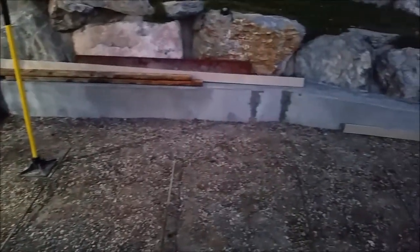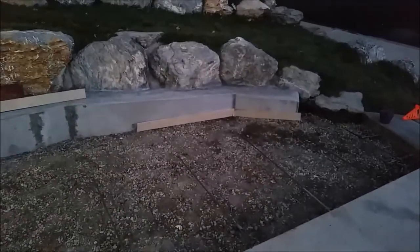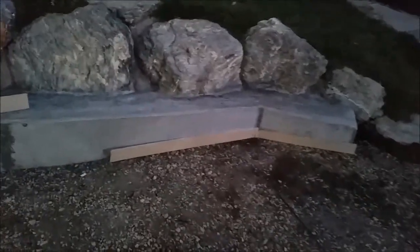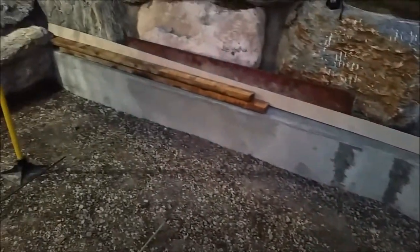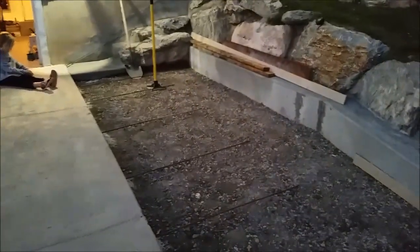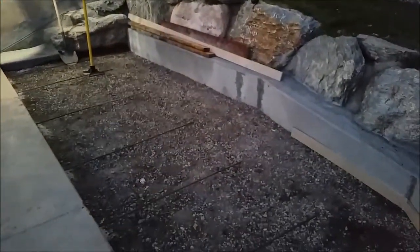There's the footing or little retaining wall we poured to support the rock wall — we got that done. I showed you the video before of the rebar we had set up and the forms that were there. It turned out really nice. We drilled in a few rebar, leveled out the ground, and compacted it down with the road base to make a spot for the final slab. The concrete project is almost there, looking good — hopefully pouring this last section tomorrow.